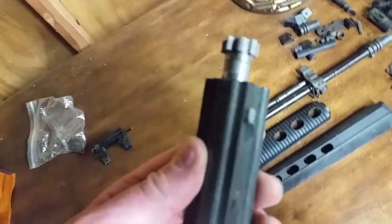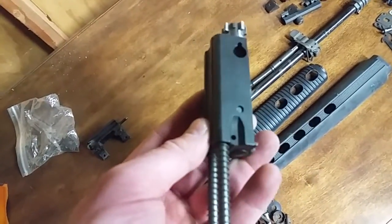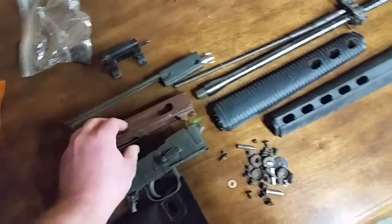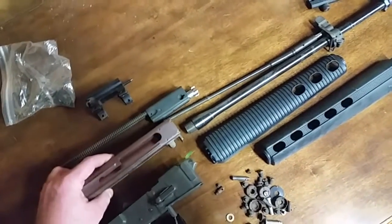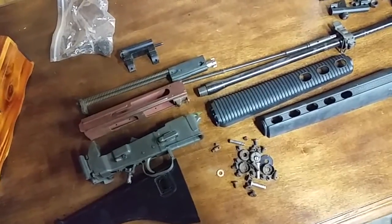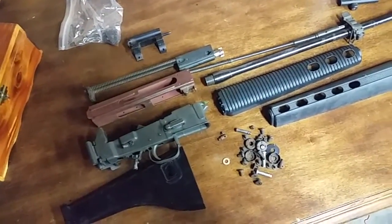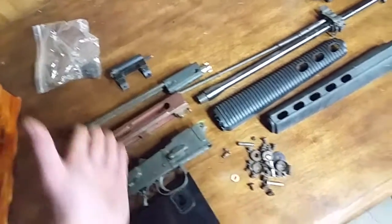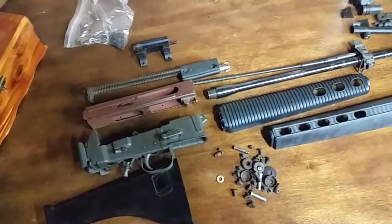These are really cool. If you've never played with an AR-180, this is actually an AR-18 bolt because it's got the trip. It's not an issue if you don't have the fire control components. The difference between the AR-18 and the AR-180 is actually a little protrusion that sticks out of the upper, which gets you into a weird situation where on parts kits, the upper on the machine guns is the machine gun and the lower on the rifles is the firearm. So most of the parts kits you'll find will have a torch-cut lower and a torch-cut upper.